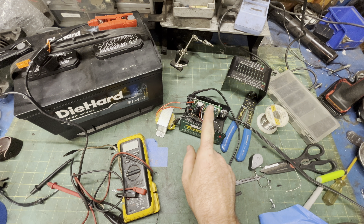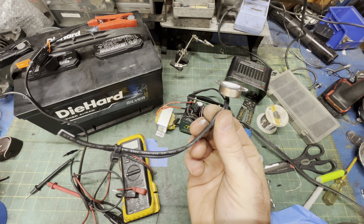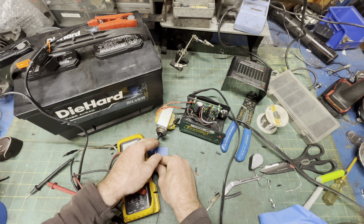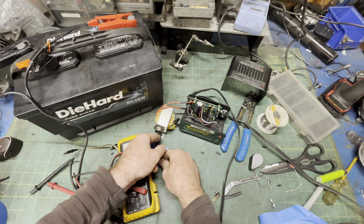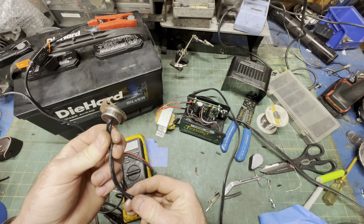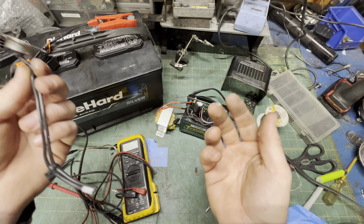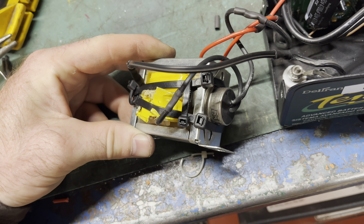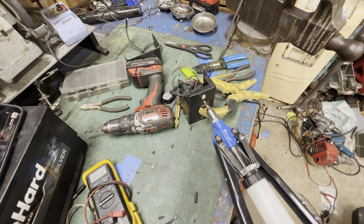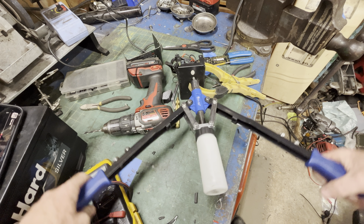The transformer isn't even overheating, which is fortunate, as I no longer have overtemp protection. So this is gonna burn my house down. Just to be safe, a 120-degree Celsius thermostat switch — these are like 50 cents apiece — and I'm going to professionally and securely fasten it to the side of the transformer for some level of overtemp protection. This'll be nice, because if it blows, it'll just reset again when it cools down. Self-regulating. Is it the right rating for this application? Like most of life's important questions, I don't know the answer either. But confidence. I know I said this was a zero dollar fix, and technically it was — I only added the 50 cent thermostat switch, because I'm a mega weenie junior, and if you're a real man, you can just skip this step.